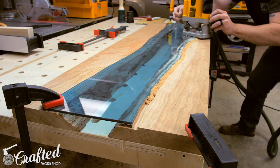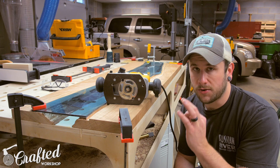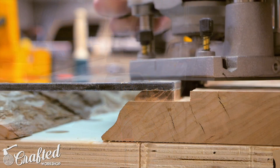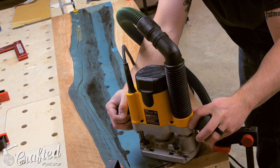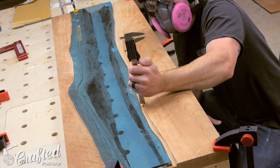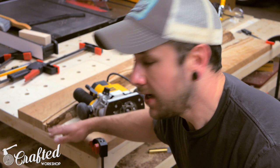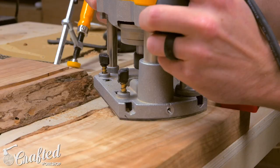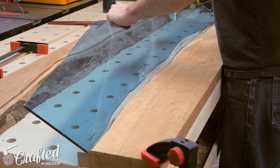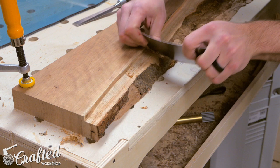The first pass went really well — it cut super cleanly. I lowered the bit just slightly and made my final pass. After cutting one side of the table, I cut the groove on the other side using the same technique, and confirmed the depth using a set of calipers. With the groove routed, that established the line against the glass, so I just needed to remove the rest of the waste freehand with the same router bit. I stayed well clear of the line, and with the entire inset area cut to depth, I test fit the glass and it fit perfectly. I then cleaned up any bit marks left behind with a card scraper and sandpaper to get the inset area nice and smooth.